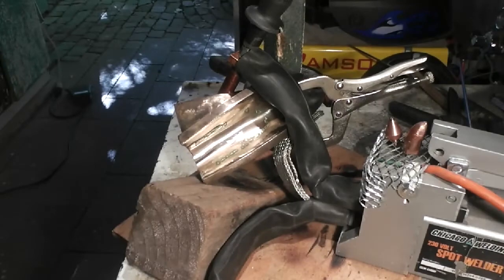This piece of bronze sculpture is set up with three bottom cables for welding several medium-sized pits. One pit was welded but missed the mark and was reclaimed with a 1/16th inch drill. The pellets are larger in diameter than the pits. The pit is fluxed, a pellet is moved into place, and then welded.